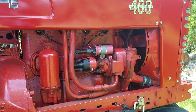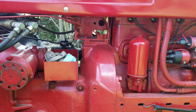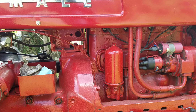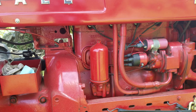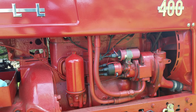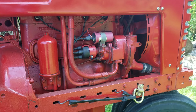It has been overhauled — it has what they call a 450 kit, so it's a 281 cubic inch with pop-up pistons, but what brand I don't know. It had a clutch and a torque converter put in it. The original owner's friends told me that after the overhaul they pulled a two-row head for an old 717 New Holland chopper with it. They were in low gear but the torque converter pulled through it, and I can tell you this thing is pretty stout for what it is.